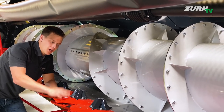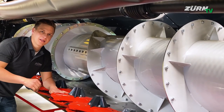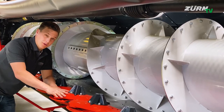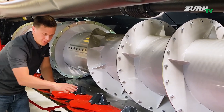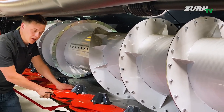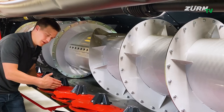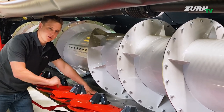From the auger we now move on to the mower bar. In the PROFICUT we have a Kuhn OptiDisk Elite mower bar installed, which is one of the most sold mower bars in the world. Let's focus on the crop flow first. We have narrow gaps between the discs on one side and wide gaps on the other side. The narrow part is where you actually cut, while you feed the crops through the large gaps over the stainless steel floor into the auger.